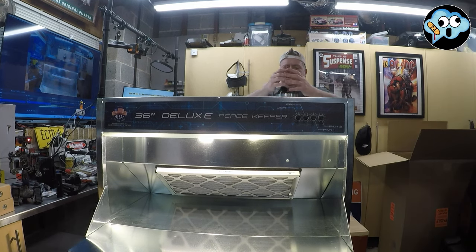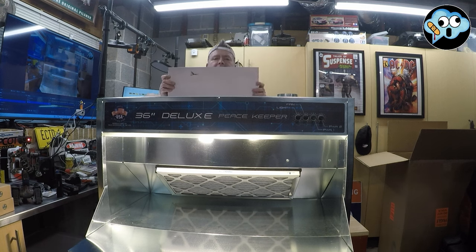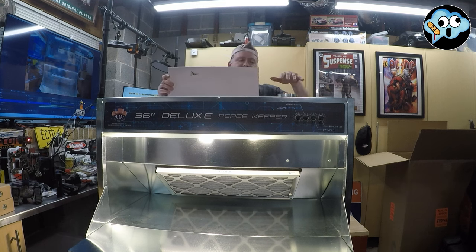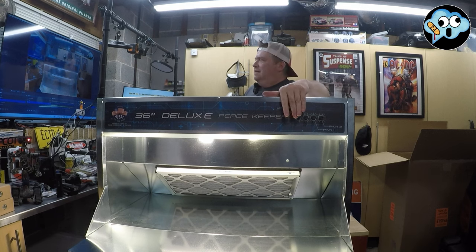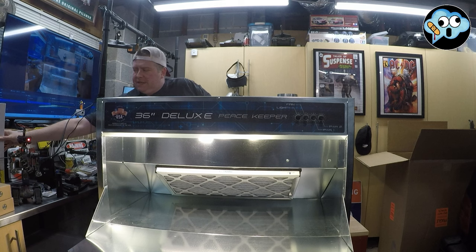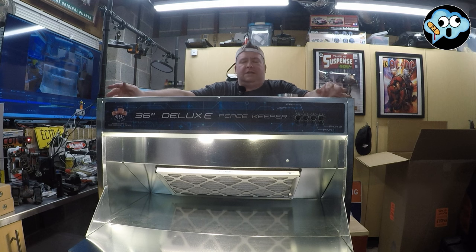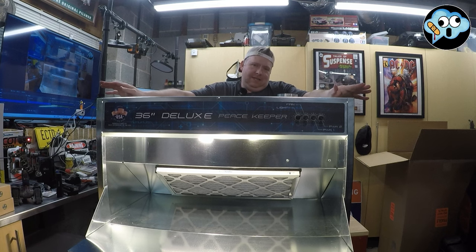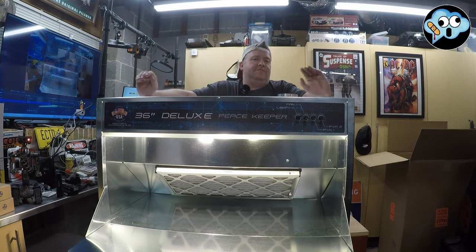We got a standard four-inch dryer vent sized duct. I bought a cheap window mounting thing for it, because you want to blow this air outside. They do the thing with the buckets a lot of times online — Barbados even does the thing with the bucket. But even with the bucket trick with water, carbon filters, activated carbon, charcoal, and all that other stuff, there's still going to be some VOCs pumping out. So you want to vent this outside. Just like resin printing, the best bet is to ventilate those fumes out of the house, out of the basement, out of wherever the hell you're doing your thing.